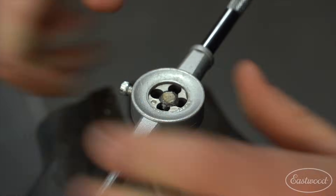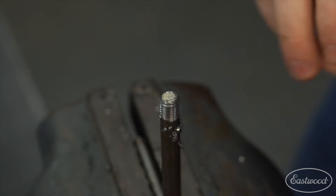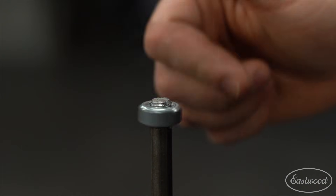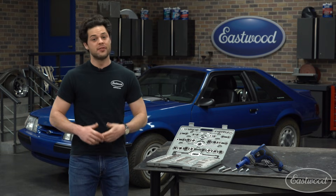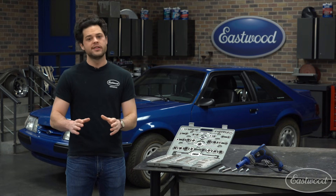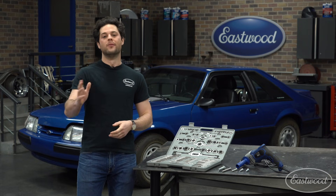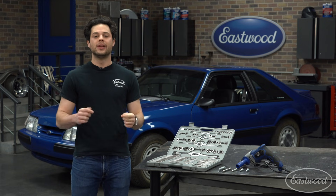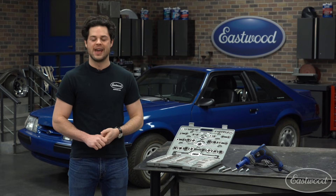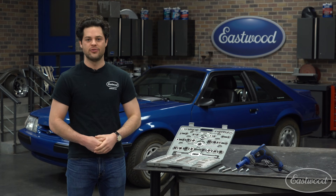Make sure it's lubricated with cutting fluid and back off the die — again, half turn forward, quarter turn back. Working with a die is a little easier than a tap; with a tap there's always the threat of breakage, but with a die not as much — they can take a little more abuse. Regardless, just go slow and let the die do the work. Once you're as deep as you like, unthread the die, hit the new threads with some brake clean to remove the cutting fluid and chips, then thread a nut on and voila. I hope you can now see the value of having one of these tap and die kits in the garage — they will save your project when you need them. I have a detailed breakdown for both the 60-piece and 110-piece kits linked below, along with all the product links. Thank you so much for watching — make sure you tap that subscribe button. I'm Joe, and keep it right here at Eastwood to do the job right.